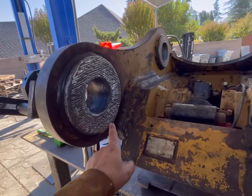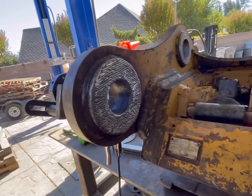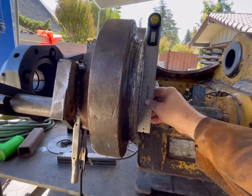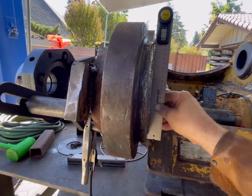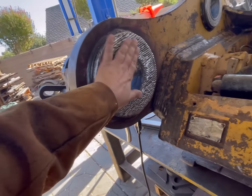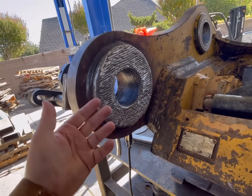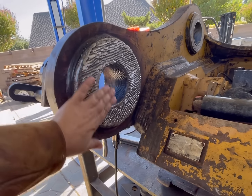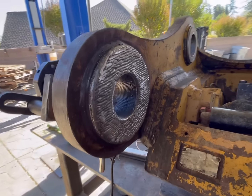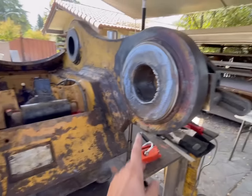All right. I ended up adding a little bit of weld right here. Just get it out of the way now, because I've been putting my straight edge on here. I just want to try to get as close as possible. And I took the grinder and kind of hit some of the high spots. That'll save a little bit of time as far as having to do a couple passes with the facing tool to get those down. So just hit it with the grinder. Then we could get started right away with a cut on there. So I feel like that side's good to go for facing.